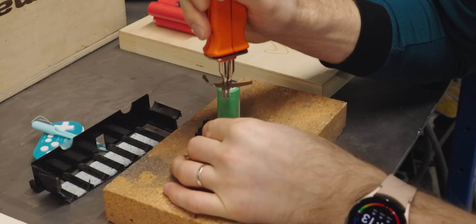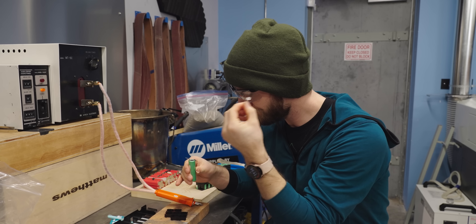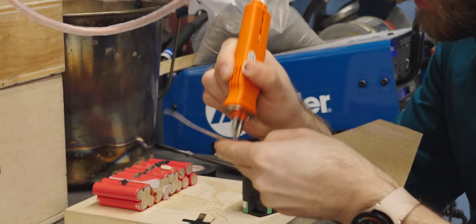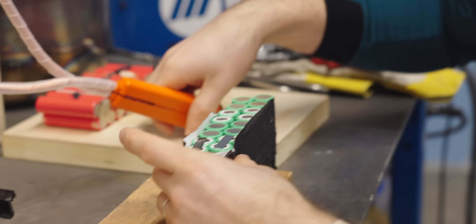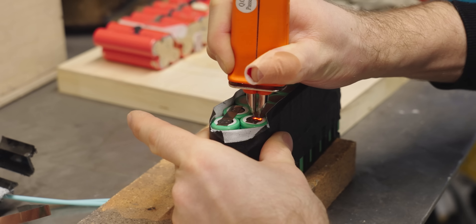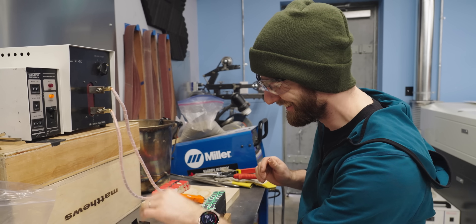The two-layer weld worked well. Now let's do that 32 more times. The spot welding is going pretty smoothly — now comes the part where we do our second layer. This is the section I'm most nervous about, because we need to do four cells in a row and this is where we first connect positive and negative terminals together.